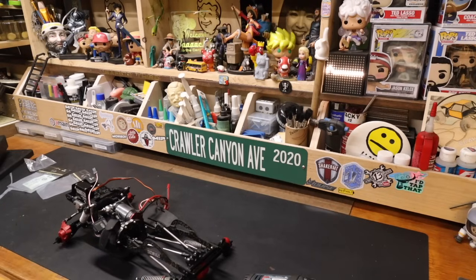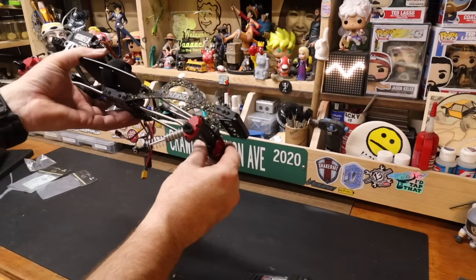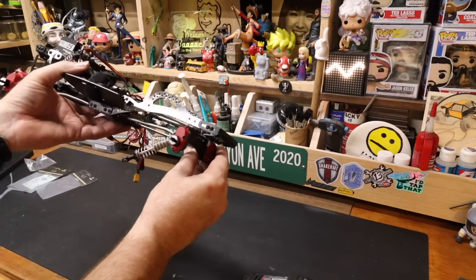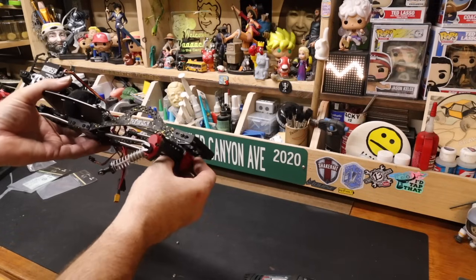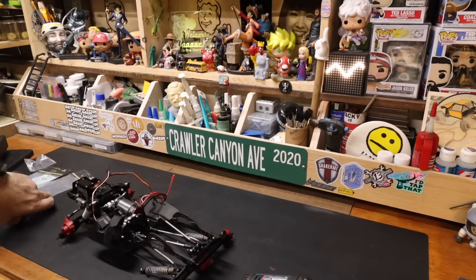I am absolutely 100% fine with 324. 324 is nice. I'm not going to make you endure it, but I do want to change those rear links because, if anything, I would like them to be longer. So honestly, maybe a 10 longer in the middle hole. So I had 95s, I need 105s. Pretty sure we got that.